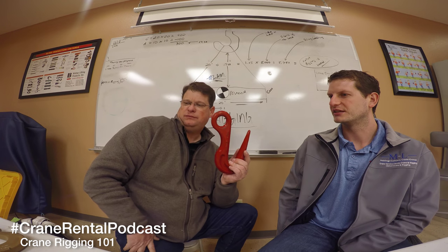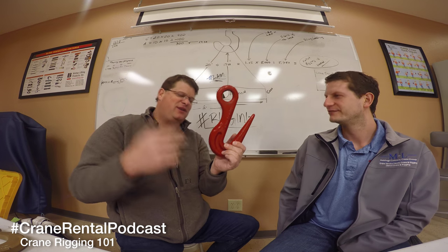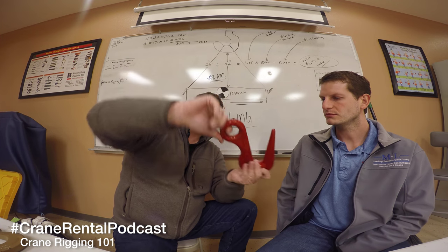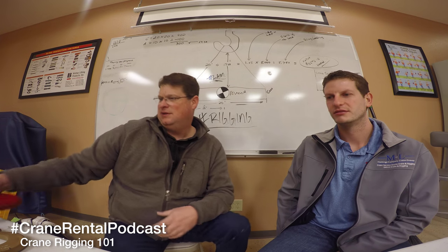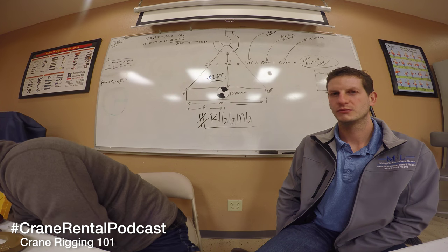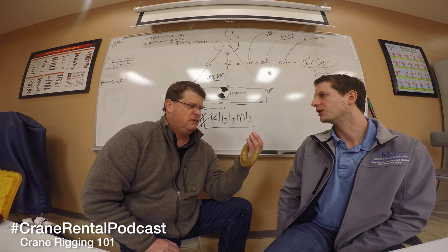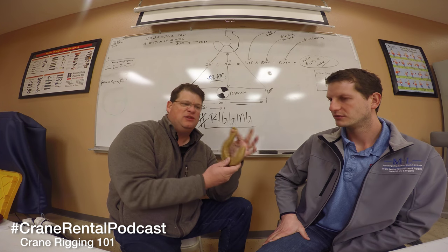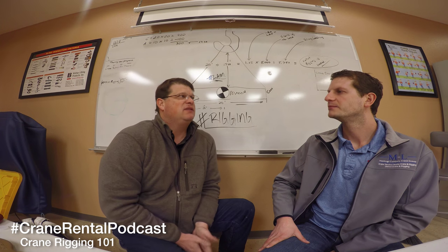I hate that expression - overhead lifting doesn't mean 'over my head' like OSHA says we don't do. It means over my head in height. So this foundry hook would be for waist height - just picking it up, moving it over, dropping it down, and it releases itself because it's weighted to do so. There's another hook - they call these pelicans or shake-outs. It's a little older one but they have handles and a groove. It's for shaking out steel - you can put it into the bolt holes or rivet holes in the steel.